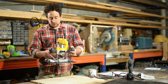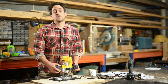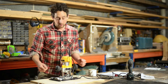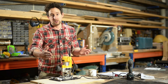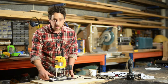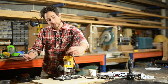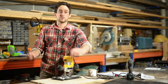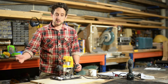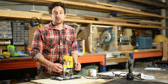Because you've got this base plate and the rods are attached with this micro adjustment pin, it works really well when you're running along a guide. Instead of having to set your guide exactly in the position needed to cut your recess or channel, you can set it give or take — say 10 centimeters — as long as it's square to the board. You can then use the adjustments and the micro adjustment to put the router bit exactly where it needs to be and run it through, instead of constantly tapping and adjusting your guide bar. I like that feature because I'm often using a big guide to cut panels or cut dados in big panels.